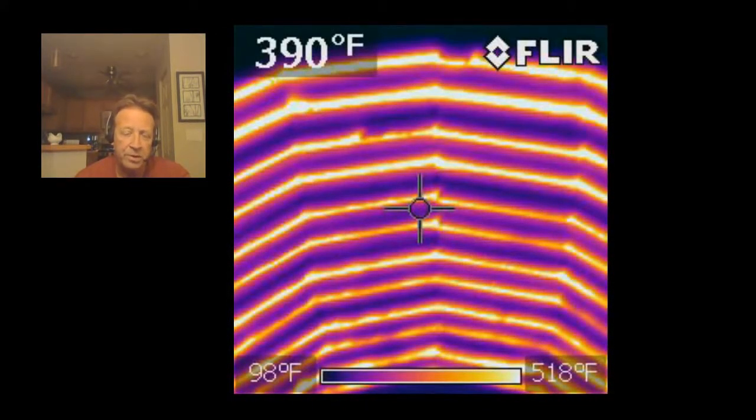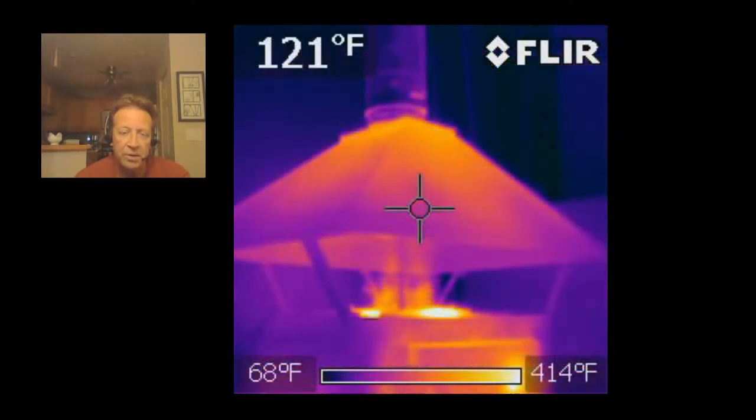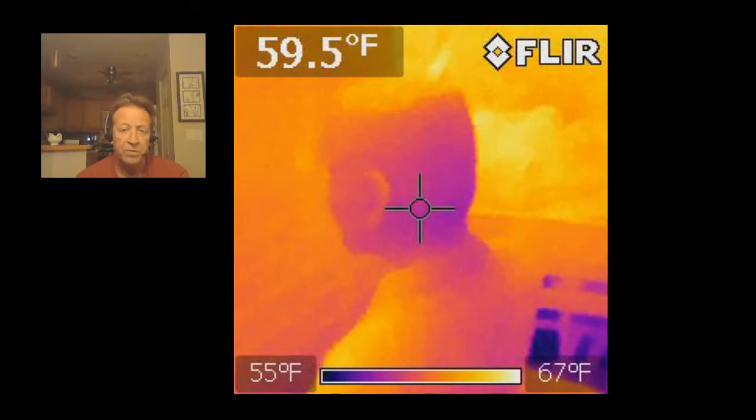The camera is great — I can look at a kiln and see if every element's lit right away. From a design standpoint, I designed a hood that did not exceed 500 degrees under natural draft, and we're confirming that at top temperature under the kiln. There are also some creative uses of the camera on sculpture work — where it's still wet, evaporation cooling the sculpture is pretty obvious under infrared.